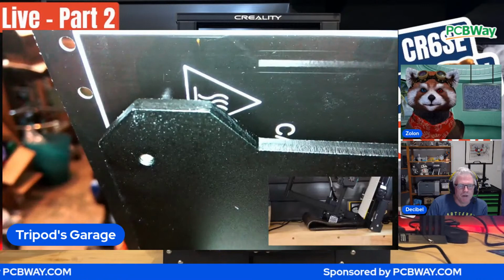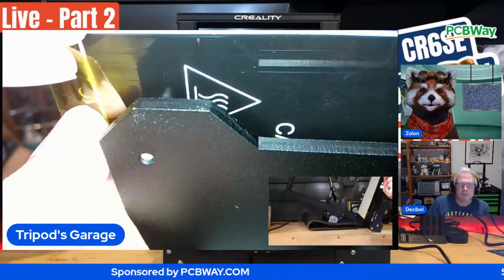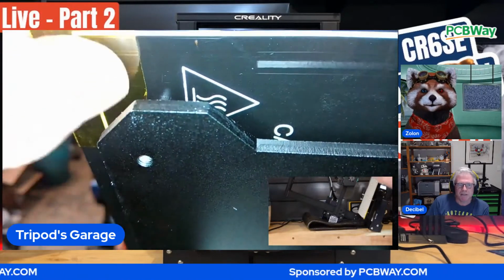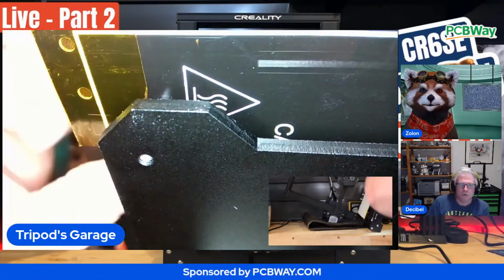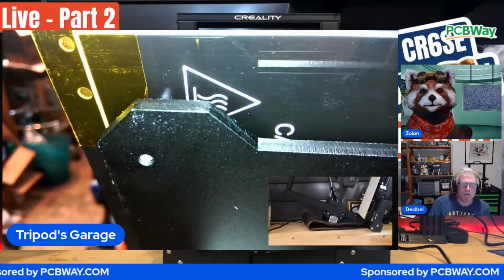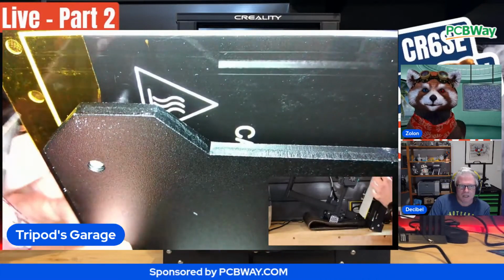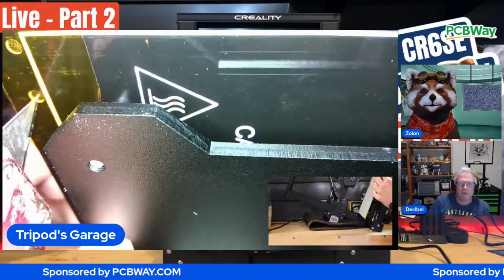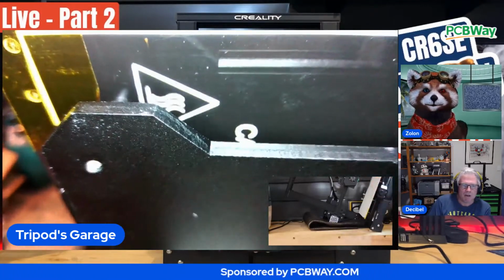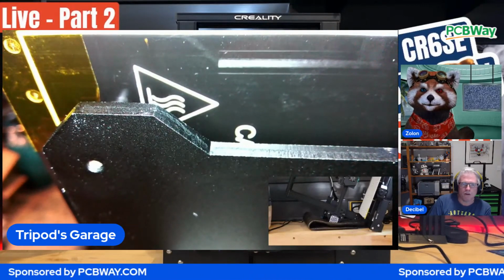And the fault is caused by the actual clamps, either your front glass clamps or the rear glass clamps, because every time you remove your glass plate and reattach your glass plate for cleaning or however you want to do it, you're basically putting strain on the clamps, and any micro movement of the clamps will cause the clamps to rub on the underside of the bed across the traces. As you can see on John's screen at the moment, the clamps will actually sit across the traces, both front and rear. And what happens is eventually you will wear through the insulation on the top of the trace.